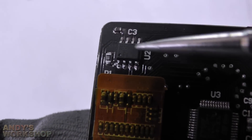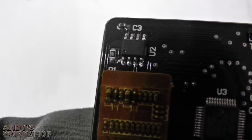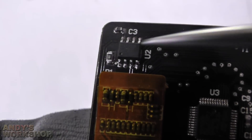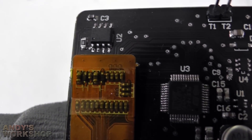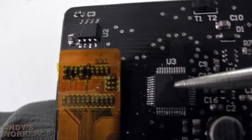Last of the components up here is this 16 megabit flash IC. It's used to store graphics bitmaps for fast access so that you can display them quickly on the LCD. It's linked by the SPI bus to the STM32, and my firmware uses DMA access to get the graphics out of it so that they arrive as fast as possible and can be pushed out to the LCD at the maximum possible speed.